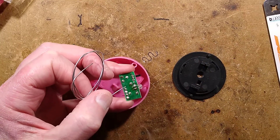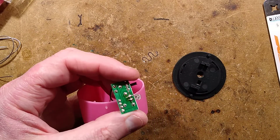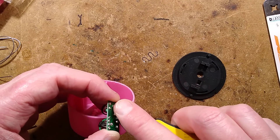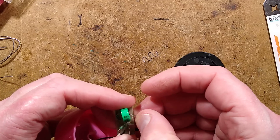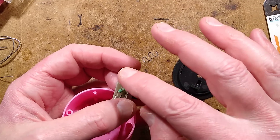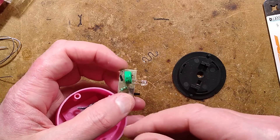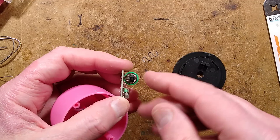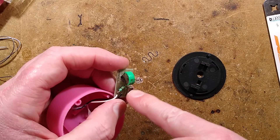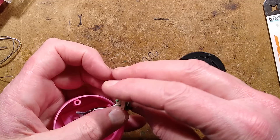This is also the point where you may want to waterproof your LED circuit board, because the water does get into them and when it gets in they get destroyed. Also, sometimes you get super duper sunshine in the UK - it's kind of rare but it does sometimes happen - and because these tiny little cells get overcharged they can explode, which is very exciting. There is the classic little 4-pin chip - I've covered that many times. Basically it acts as a diode; the solar panel puts out 2 volts, there's a 1.2 volt cell that charges up to 1.5 volts, the chip has a diode to avoid self-discharge, and it uses a little inductor - by pulsing the inductor with an internal transistor it can boost the voltage up to drive the LED.